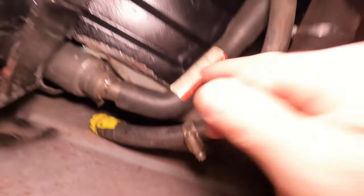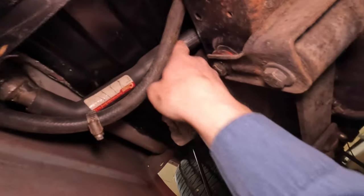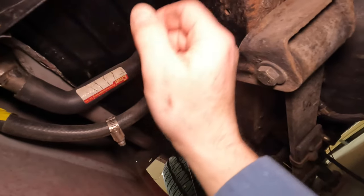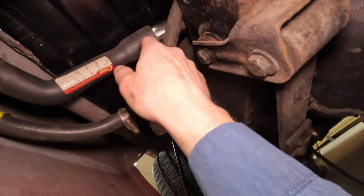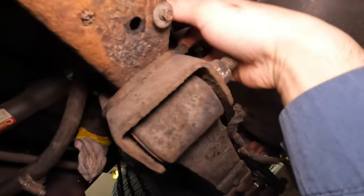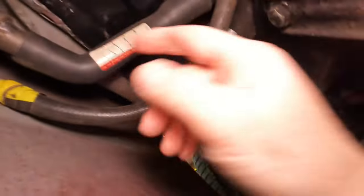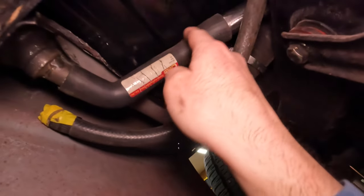So the neck I got is from a Jeep, and actually the rubber hoses as well. I ended up making a manual piece right here out of black pipe. Not my first choice, but I was having a hard time finding things that were in stock, so I went into the hardware store, and that's what fit this. And then I welded up an adapter to go into the S10 Blazer tank, which is, I think, a 2-inch. So a lot larger, pretty big step up. But the smaller diameter here will allow me to snake this through into places where it's not supposed to be.